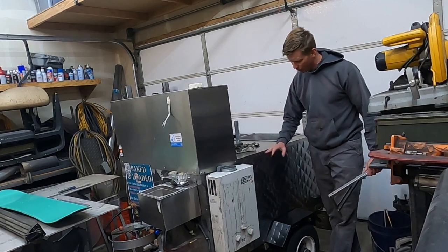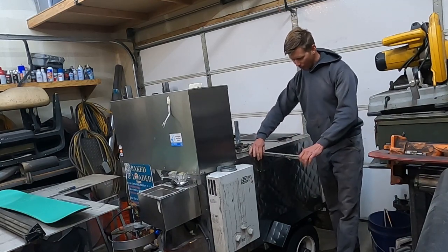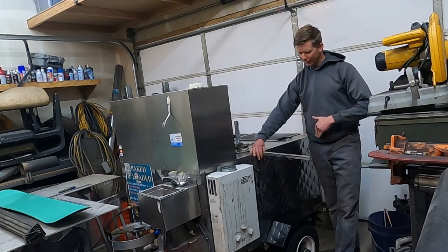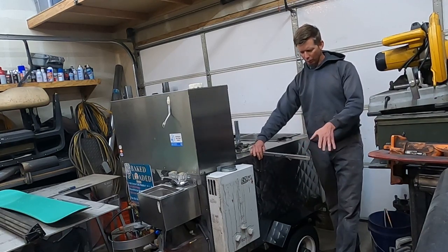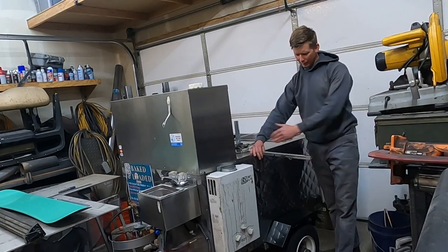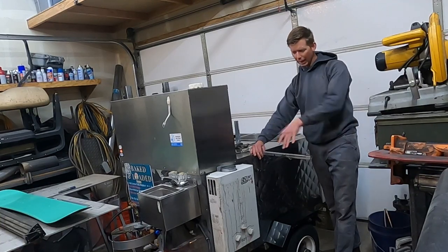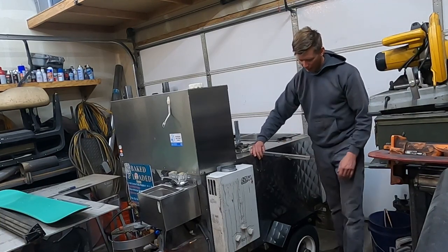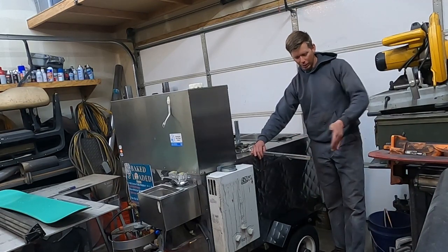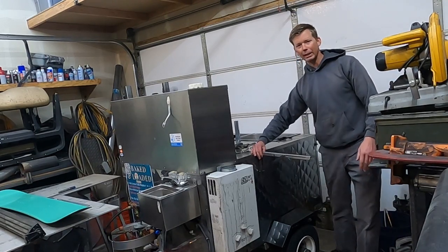And we'll weld that to the top bar. But yeah, it's going to have two of these hinges. It'll come out to about here. I think I'm giving it 19 inches and like 18 inches this way. So the griddle will have like an extra 2 inches on every side. We're also going to put a back on this shelf so that when you're scraping, you can't accidentally push the griddle off. And then we're going to give all the exposed edges here, these two, nice rounded corners, so that it's not a snagging hazard.